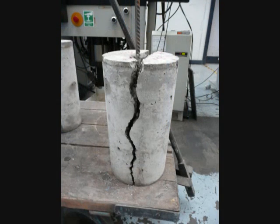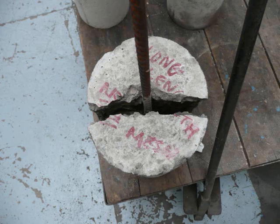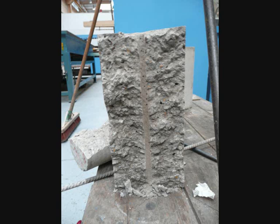These pictures show the failure of the reinforced concrete specimen which has been removed from the testing machine. Due to the way that this element failed, it is possible to conclude that the maximum load before failure was not that of the bond between the steel and concrete. Instead, it was the concrete itself that was not strong enough to resist the load and thus failed by splitting.